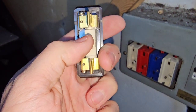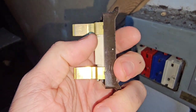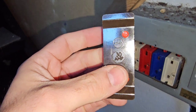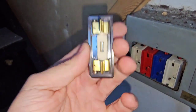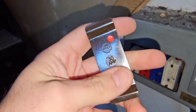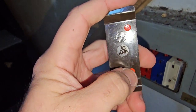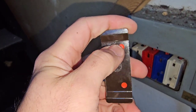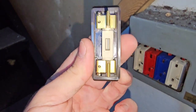Another thing is these being misfused completely by people just putting a paper clip across them, or anything else they can find — a fag packet, those sort of things. Then these become like little mini bombs to be honest, and they can get quite dicey. Something important to look out for also is any damage or cracks to the carriers. There's a different design where they've got circles on them with the fuses in them, and when those are missing that's a live part underneath. So yeah, things to look out for are the fuse wire and the carriers.